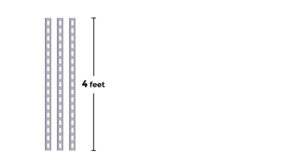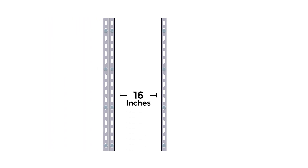With this installation, we begin with three pieces of unistrut four feet long. Using a lag bolt every 12 inches, securing the unistrut to the joist of the building. The second piece of unistrut will run parallel to the first — in our case, 16 inches apart, as that's where our next joist is. And repeat that for the third piece.